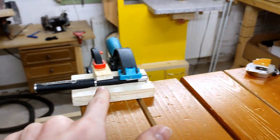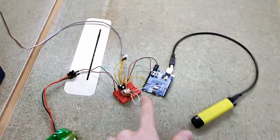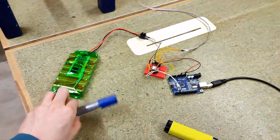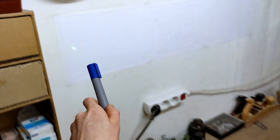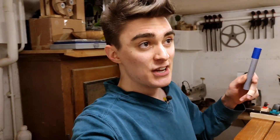The motor is being driven in quarter-step mode to do one microstep every two seconds, which is slow enough to allow me to put a mark on the paper for each microstep so we can compare their size. All of this insanity is necessary just to spread out the steps to a discernible level. I am deeply impressed with the accuracy and resolution of this stepper motor — just a shame it's basically too small to drive any real CNC in direct drive.